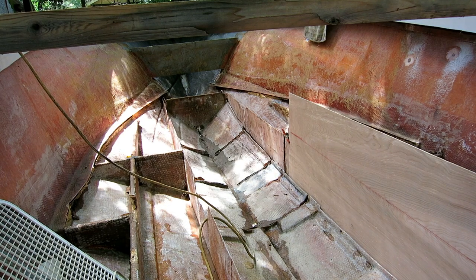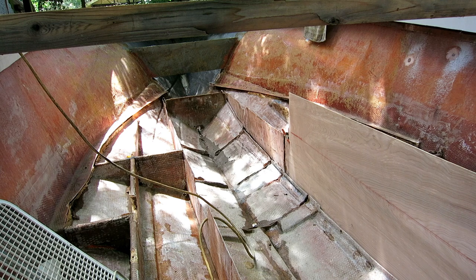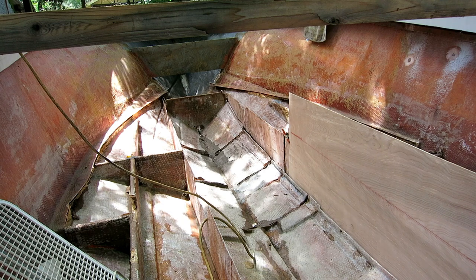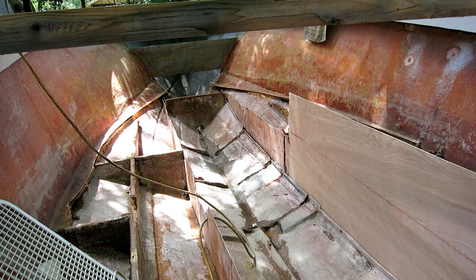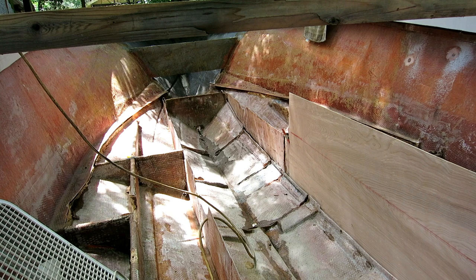That's all based on how the boat is sitting in the cradle - I don't know how it sits in the water. I think the boat is going to be lighter than it was originally. The single engine I'm putting back there doesn't weigh as much as the two 90s that came on the boat, although it'll be on a motor bracket sticking out further back, so there's a complication there. I might raise it a quarter in the back and a half in the front and go with it.